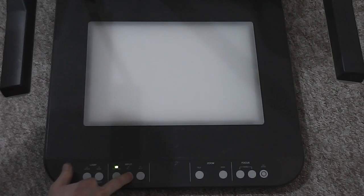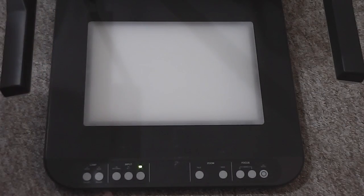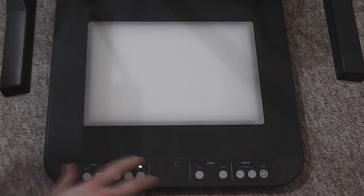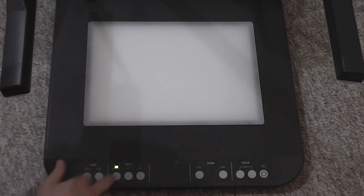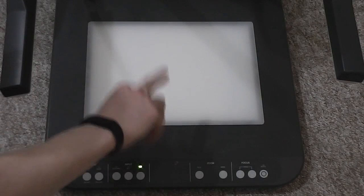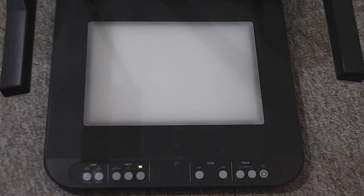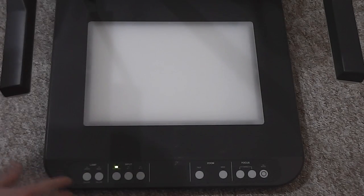The control here selects the different sources. It's got two AV inputs as well, so you can plug in a sound and a video source and have multiple things running, using this as a central hub. If you're focusing your presentation around a device like this, you can switch between the internal camera and the two other input sources. These work. I've fed a video feed into this thing and looked at the output, and what you feed into either of these comes out, so that side of the circuitry is great. Obviously it is dead coming from the camera, there's no sign of activity there.